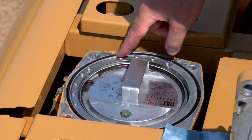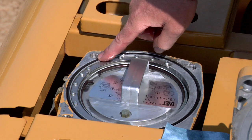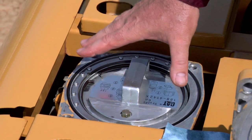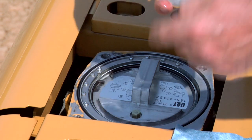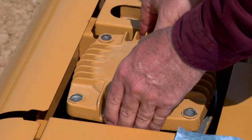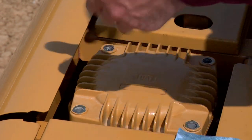Look at your O-ring and make sure it's not cut and is still nice and round. If it's starting to get flat or you see cuts in it, you need to replace it. If it looks okay, you can reuse it. Take your cap, line up your slot with your handle, put it back together, put your bolts in, tighten them back up, and it's all done.